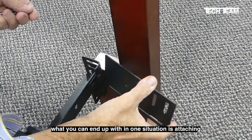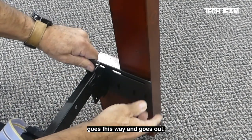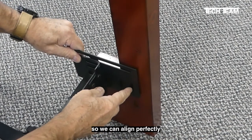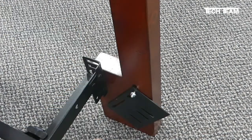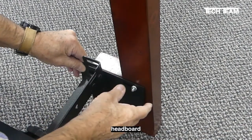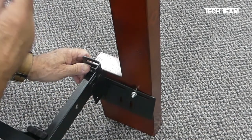What you can end up with in one situation is attaching the interface bracket to the end of the headboard right here. It goes out, and we can move it up and down with these different holes, and then we can set it because it slides back and forth — they're slots — so we can align perfectly with one or both of the holes on the headboard or footboard. The key here is to just loosely connect the bracket to either the headboard and/or to the bracket on the end of the bed frame. Because once you attach it loosely, you have the option to move things back and forth and up and down. And don't forget, you still have to do the other side, so you don't want this tightened up too soon.